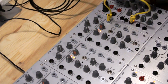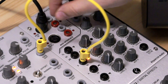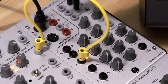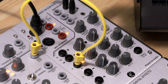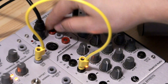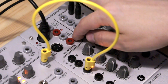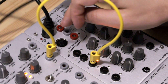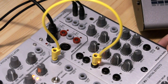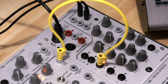The mixer has a CV and gate output that acts as a MIDI converter, with a through connection. The CV and gates can be used in pairs together or separately. You set it up by pressing the set button, and the LED blinks in different patterns to show which mode you're in — separate MIDI channels, split keyboard, polyphonic, or duophonic. There's an ARP Odyssey-type mode, and you can assign CCs or pitch bends to generate control voltages.